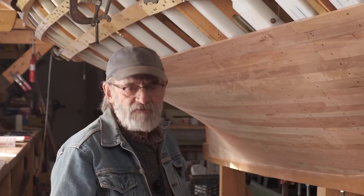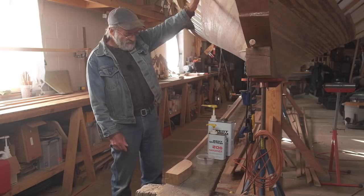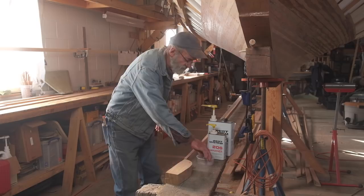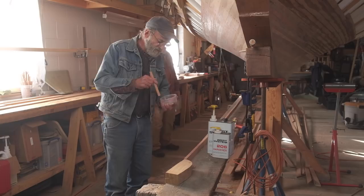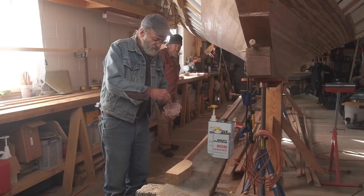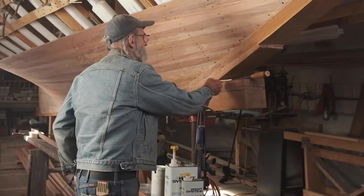So we try to make sure we don't glue the plank into the mold. I've taped off the molds. The next thing for us to do is to mix up some glue and glue it in place. We're going to spread one edge with it just as thin as it mixes. Then we're going to thicken it a little bit and spread it on the other surface, then mount the plank and put it in place. We're going to use two pumps of glue — that's all we're going to need. Done this probably a million times in my life. The next thing is to grab a brush to spread the glue.